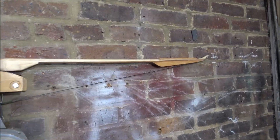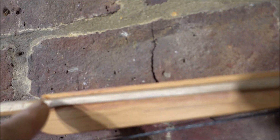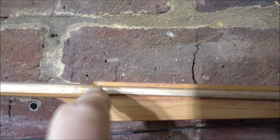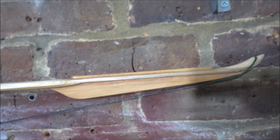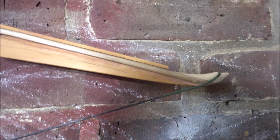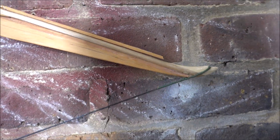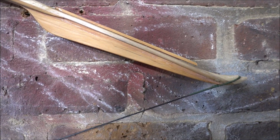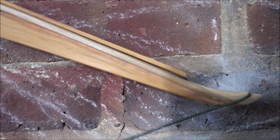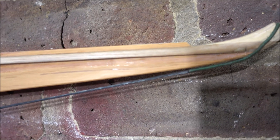I've got the new levers glued on, and what I've done this time is I've actually epoxied on a little indicator lever — just a tiny little spot of epoxy that'll lift off later — so I have a really good look at how much the levers flex. You can see it's moving a bit; that's 30 pounds. Let's see if I can get it up to 40. There's 40 pounds — you can see that's a lot less flex than there used to be, but it's still a little bit of flex. That's fine.